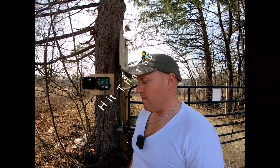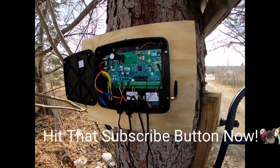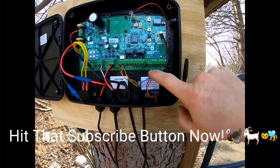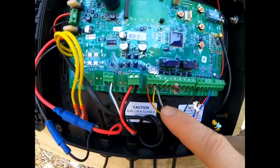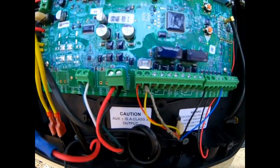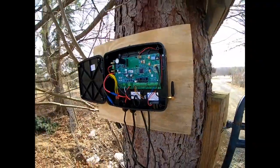I was able to use my old one which was FM 138, it's 50 feet long. Simply your blue goes to exit, black goes to common, and then your ground and your yellow go to auxiliary negative, and then your red goes to auxiliary positive. That's how that's gonna set up for your ground magnet.